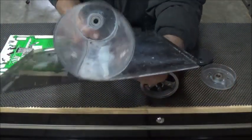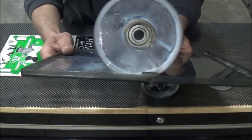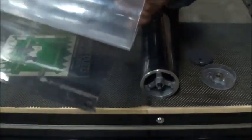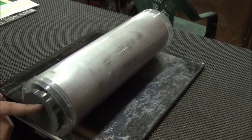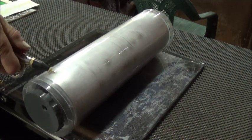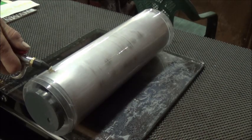It's just a plexiglass tube that I made — I rolled it in an oven around a piece of three-inch hard iron pipe. I've glued in the rear side with the bearing holder already set in place, and we've got our air input right here. That's basically the entire system. Alright, we've got our Tesla turbine all set up. Hopefully with the hole right here at the end in the camera you can see the RPMs of that hole as an indicator of how fast we're getting going.